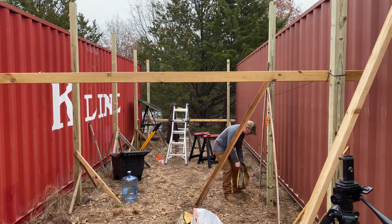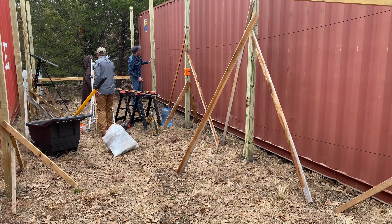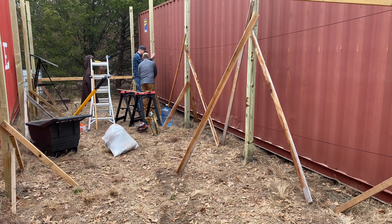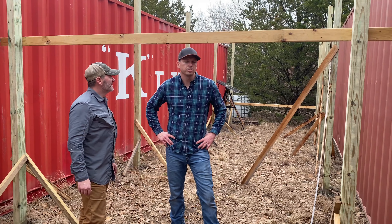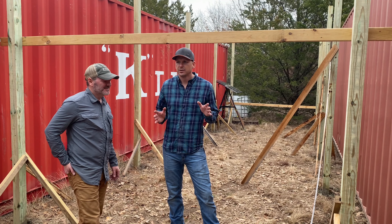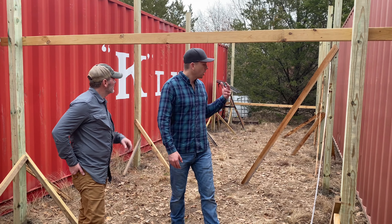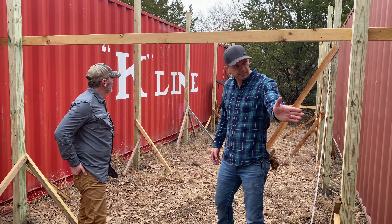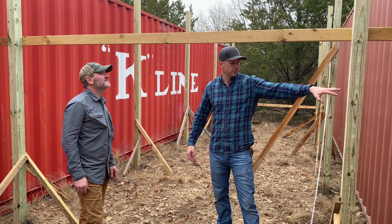It's really starting to look like something. Well, that was a great day. We got all of the posts set — that was probably the easiest project we've done in terms of no unexpected issues. We got all 10 posts put in. We're about 5 feet off of the front to allow for the doors to open up. These are 12-foot 4x4s put in.